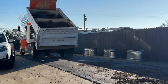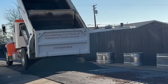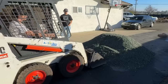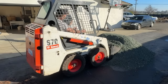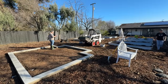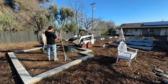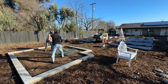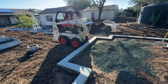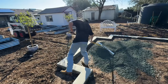Installation day started with the aggregate base being delivered. Aggregate base, sometimes called AB — the one I chose is called AB blue — is a mixture of gravel and dust that you put at the bottom layer of foundations, walkways, even sidewalks. The consistency of the gravel allows you to tamp it down to a level surface, so whatever you place on top will be level and secure. We started by moving the aggregate base from the delivery pile into the greenhouse, a job made significantly easier thanks to a skid steer I rented.